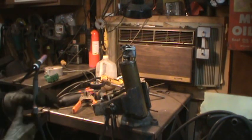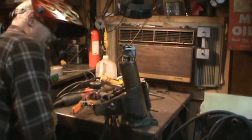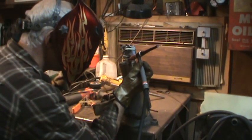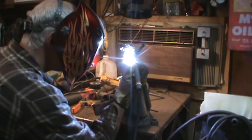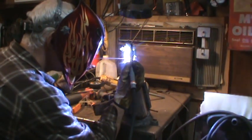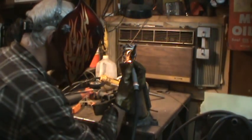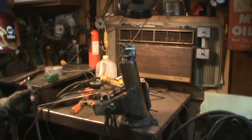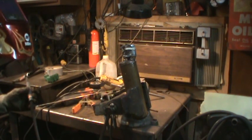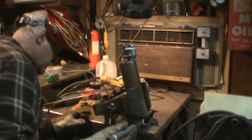Let's see if I can make a little puddle without blowing through. If it's on steel it's easy because the steel melts at a lot higher temperature — this stuff's all kind of melting at the same temperature. I think. Let's see if I can make almost a bubble. I'm going to turn this up more — we're on 86, I'm going to bring this up to 100. See if I can melt that puddle. Might have contaminated my tip too. Excuses!